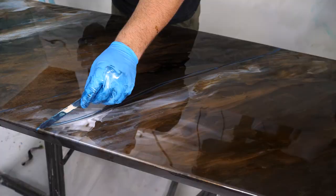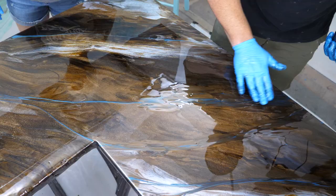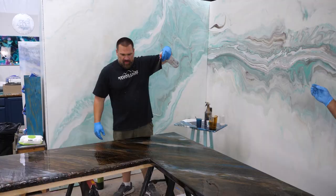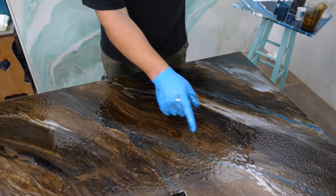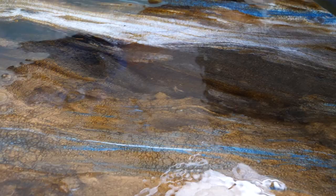All right, I can't wait to see what you have in your back pocket. I'm done — I'm going to let that alcohol dissipate. One thing you don't want to do is pile on tons of alcohol. Give it a little mist and let it dissipate — you can always come back and mist it again. With Stone Coat Countertop Epoxy, depending on your climate, temperature, and humidity, you're going to have an hour and a half to two hours easily of working time. So I'm not in any big rush.